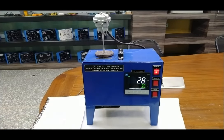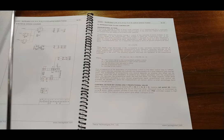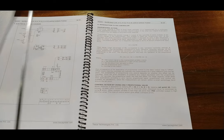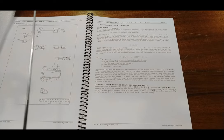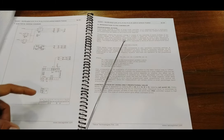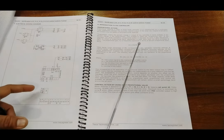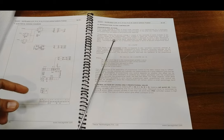Now we will look at the proportional action — how it works. The proportional response is the basis of the three-mode controller; it is characterized by a continuous linear relationship between the controller input and output. If the other two — integral and derivative — are present, they are added and called proportional integral and derivative output. The proportional means the present change in the controller output is some multiple of the percentage change in the measurement.